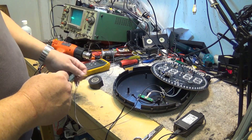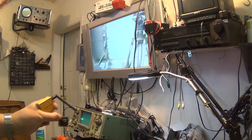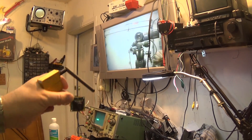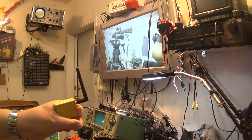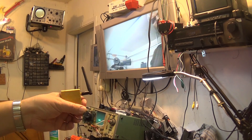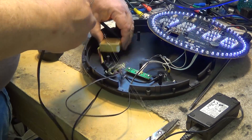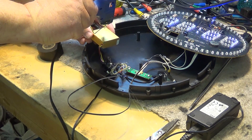The yellow lead is the video line — I'll grab another piece of heat shrink here. There's the picture from the camera displayed on my monitor. This is the wireless transmitter, just sending the signal out. I don't have an antenna on the receiver but it's sending the signal, and that's going to be mounted inside the clock momentarily. We're going to mount it by putting some hot glue on the back of the module.